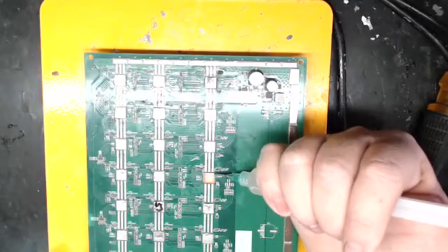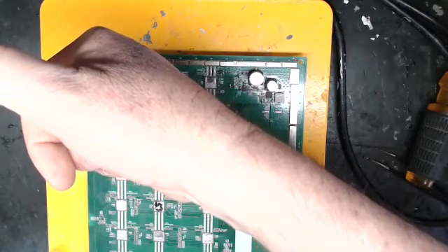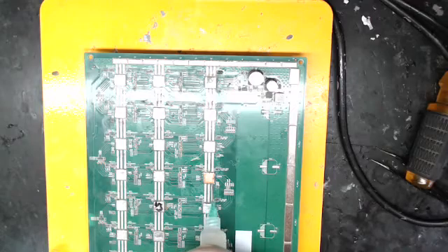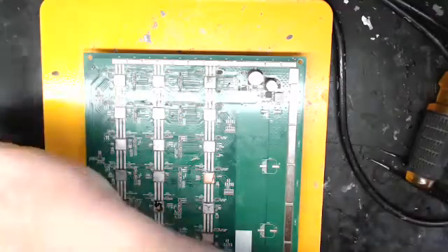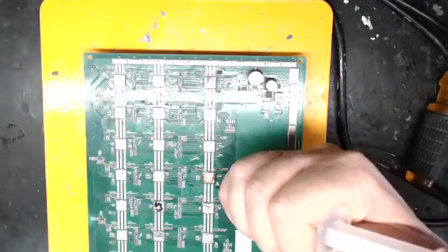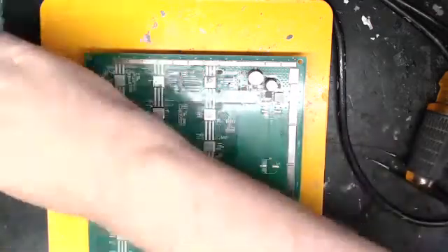What I'm going to do is apply flux to the legs — a good amount of flux — so they're good and soaked when I heat them up. This is what I think is called reflowing the chip. I do it on either side just in case. I've got a pretty good coat of flux here. I'm also going to protect these resistors — throwing some flux on these again, these capacitors, and these resistors, so those guys stick down.